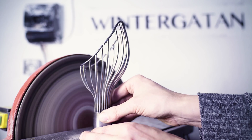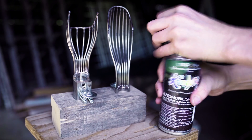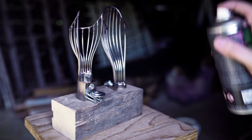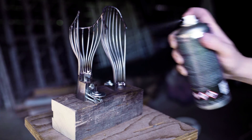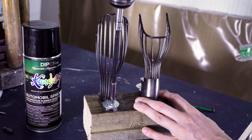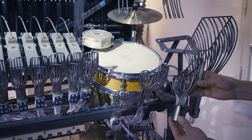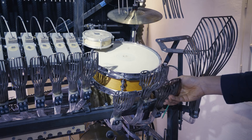When I told about this problem we were swamped with the idea to dip the funnels in Plasti Dip. I didn't have Plasti Dip but Alex ordered products that are like Plasti Dip, so it was time to take the funnels off the machine and start coating them with this transparent rubber coating for automotive industries. Today I've been making a lot of coatings and I'm not really happy yet, but I can already feel that the metal sound is gone. It's more of a duller sound. The feel of this funnel is completely different and the rubber looks great - it created a nice gloss.